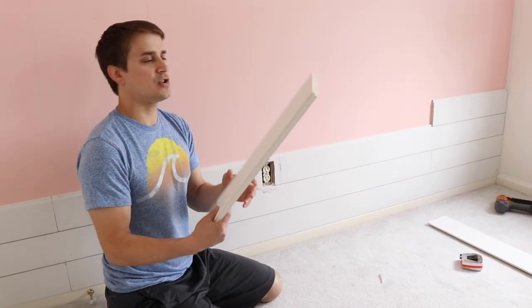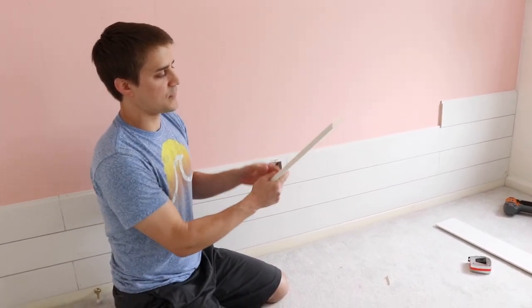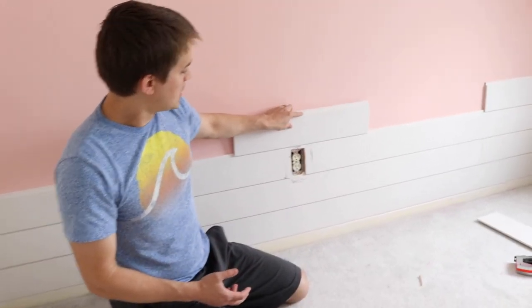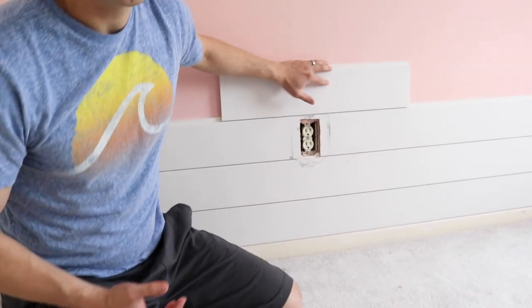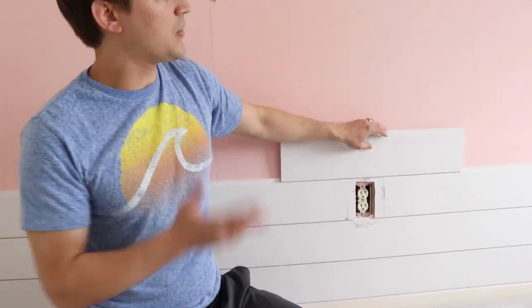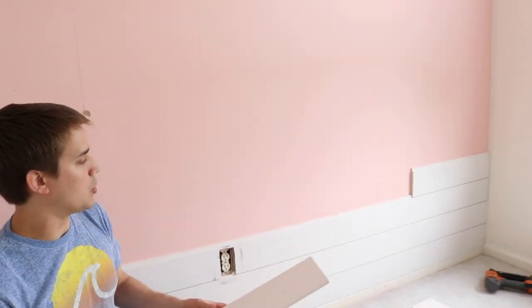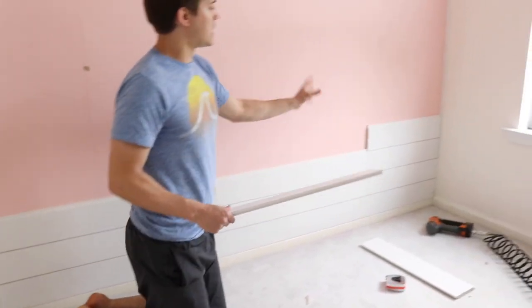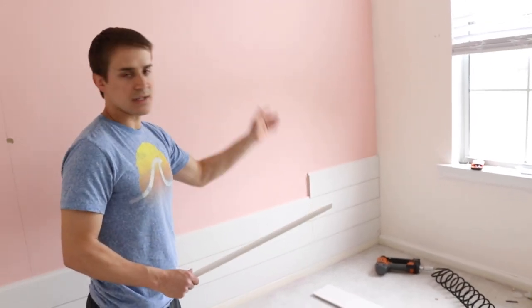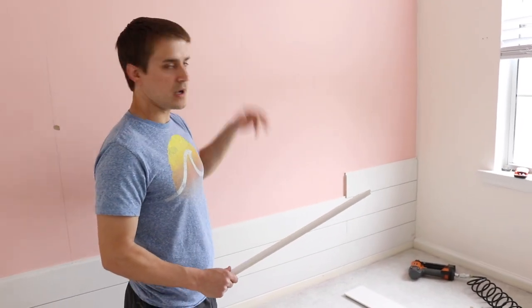As you go, you're going to want to make sure the pieces are resting in there fully. Sometimes the boards are not completely straight so they need just a little downward pressure — you can go to the end and look and see. We've got a 10-foot wall and of course eight-foot boards, so for that last two feet I'm alternating every other board, putting the seam on this side then the other, taking it all the way up.